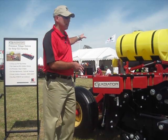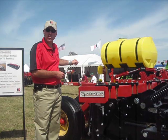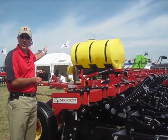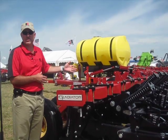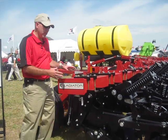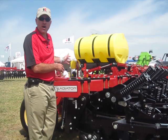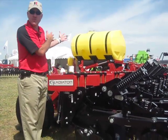The unit comes in a lot of different variations with size, in 12 and 16 row applications, with liquid or even dry fertilizer, with the ability to place anhydrous, liquid, or dry with the shank. The unique toolbar system is a flip-and-fold toolbar that allows for easy servicing of the units when they're in a raised position.